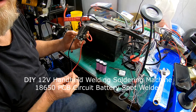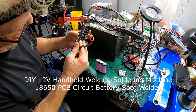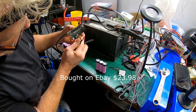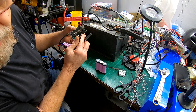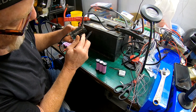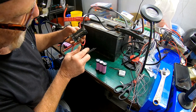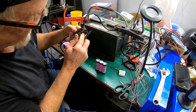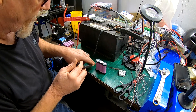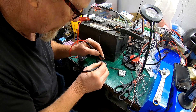Okay folks, I've got this little do-it-yourself welder here. You just connect it to your battery, you've got one button on it. You can press it once, twice — three times is max power. That's one pulse, so when I weld I only hit it one time; now it'll hit it twice; now it'll hit it three times. So that means it'll pulse three times to get a real good bite — a weld between the two surfaces.